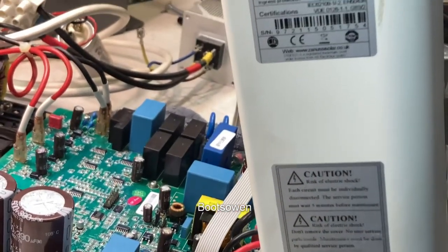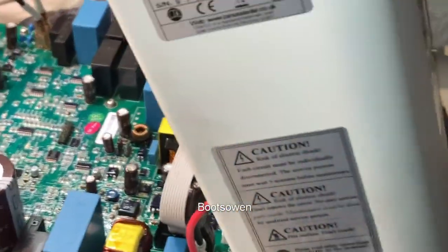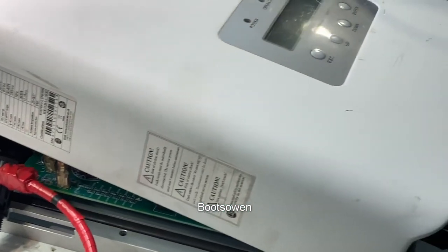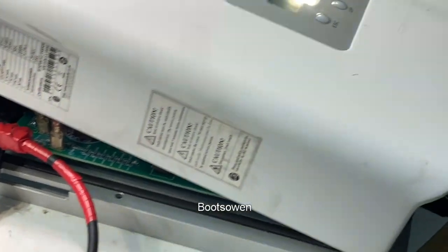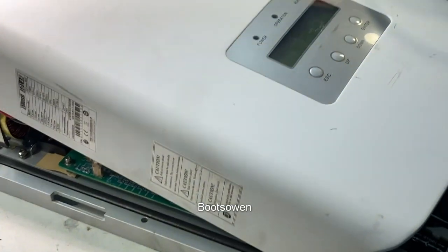Zanussi are having these made. I've tried to read about Zanussi, but there's very little on the internet anymore. Zanussi Solar is just a company that uses the Zanussi name and none of the parts are Zanussi parts. But I'm happy — I got this maybe a month ago from Ian Matthews, who has a YouTube channel as well. He was going to scrap it out, but I said let me test it. So I've tested it now. I think this is ideal for running maybe two panels — it'll be underpowered at two panels. With 2000 watts you could probably run eight 250-watt panels, but a lot of panels will start over 30 volts, so two panels together might get this thing fired up and then it'll be running under all of its specifications. And if it's running under its specifications, it should last a long time. It's only eight years old — it's probably part of a system that was either just being pulled out or upgraded to a bigger system.